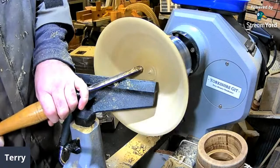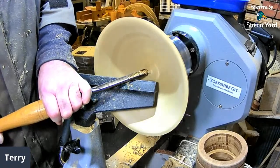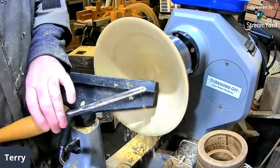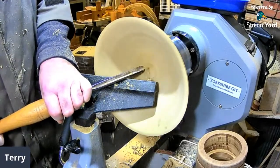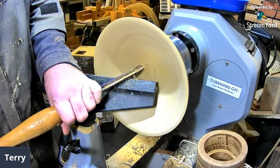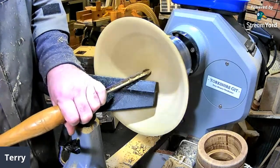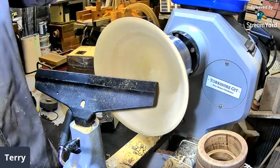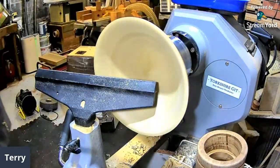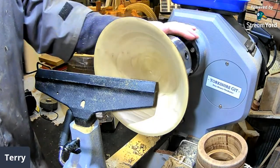If you wanted to turn something, I'd turn up some submarine blow valves. The tolerances on them had to be within 1/10,000th of an inch, or they'd just throw them in the bin, chuck them back in the melting machine and start again. So this machine was really accurate, but you had to turn the different faces of it: entry at the bottom, entry at the top. The top of it had a clamp. The cast itself had a valve inside, and you could turn these on the independent 4-jaw chuck and put any off-center you wanted on it, set it up and don't touch it till you finished it.